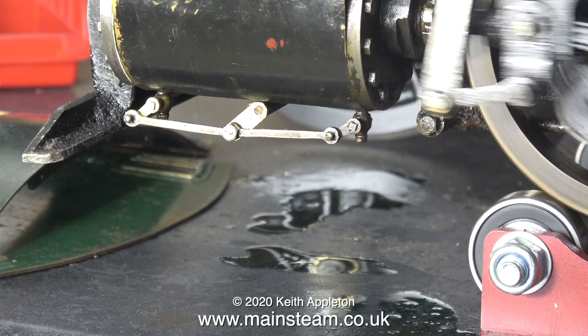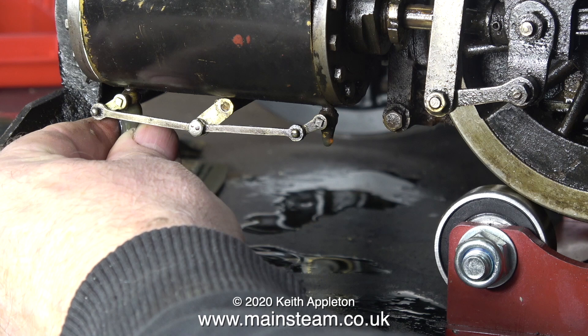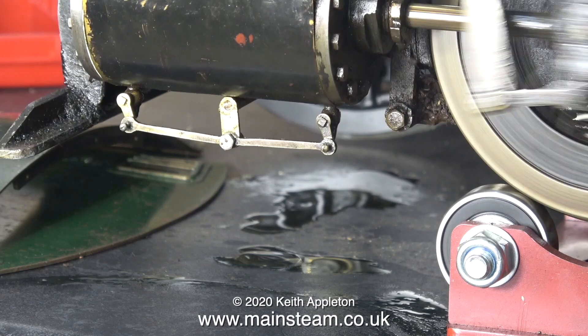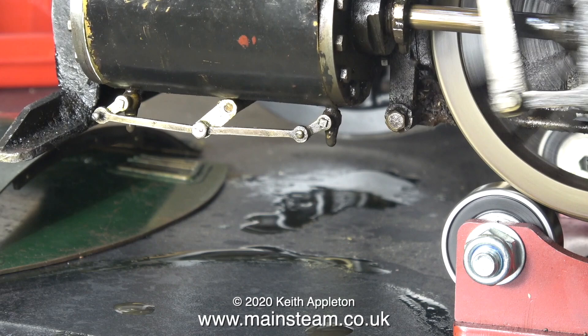That's not a good enough test for the drain cocks. What I'm doing at the moment is injecting some oil into the cylinder — quite a lot of ordinary lubricating oil from an oil can used for getting to inaccessible places. The engine definitely didn't like having so much lubricating oil in the cylinder. The main thing is, with the drain cocks open, the oil is coming out of the cylinder and it's a very dirty black colour. The amount of oil is dwindling now, and it's much dirtier than it was to start with. This is a simple job that could have been made a whole lot worse had the twist-drill broken off in the drain cock.